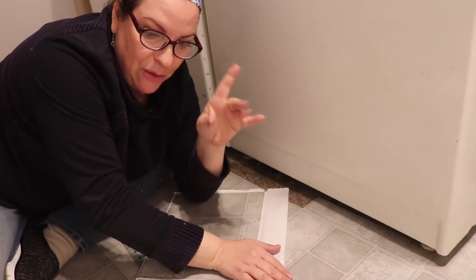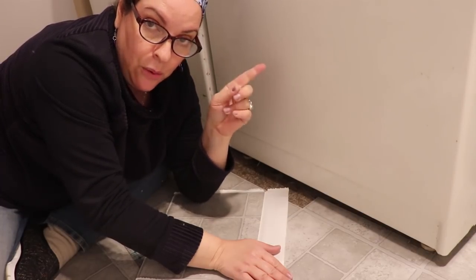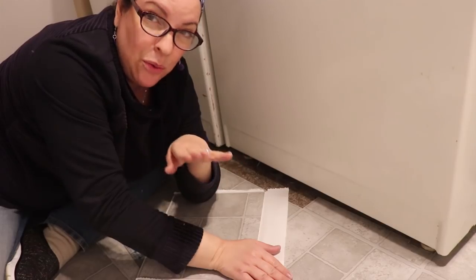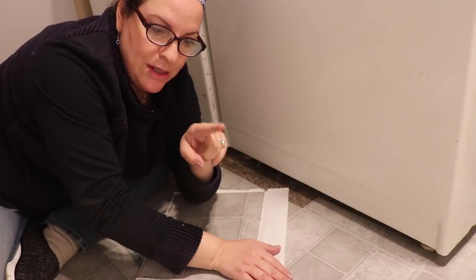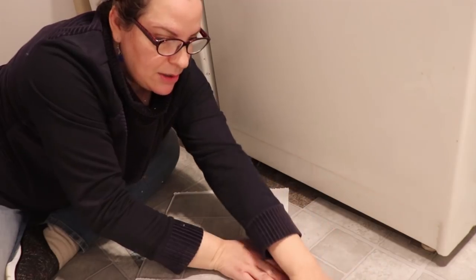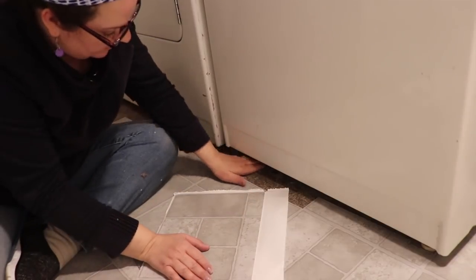So what I'm going to do sometime this week is the same thing I did upstairs. I'm going to take it off the floor, not redo the tiles, but really flatten them around it, even though the floor is really uneven. And I'm going to redo the wax seal. And then once I've done that, I'll reposition the shim. So until then, they'll have to use the toilet upstairs. Because I really don't want to have to do that today. Not that I'm lazy. I just don't want to have to do it today.